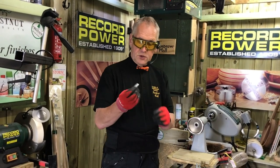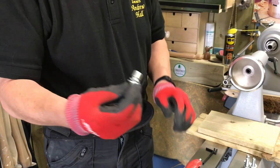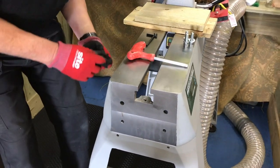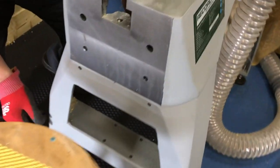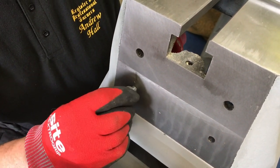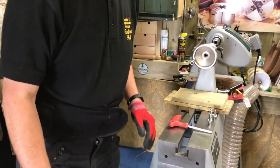In the pack you've got your studs — they're 8mm studs. They go into the bed: two come out of the bed through into the bed extension. One goes in from the bed into the bed extension, and one goes through the bed extension into the thread on the other side. There are also two grub screws going in here just to tweak the bed to get it running nice and smooth with the tailstock.